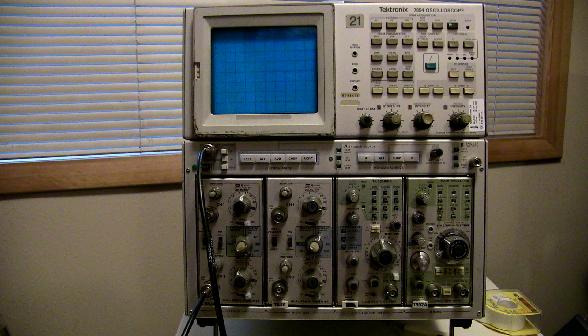The instrument in the second repair showed the ticking power supply problem. Even with no plug-ins installed, the instrument would not start up. No front panel lights were on, or they would flash occasionally, and the fan was not running. A faint ticking noise about once a second came from the power supply.